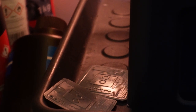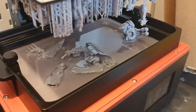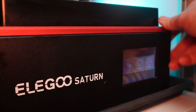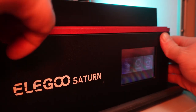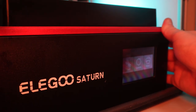But it has all of these small raised bumps on it. And whenever I got my Saturn, I kept getting failures when realistically I shouldn't be getting any at all. I leveled the bed many times and I checked all my settings and they were all correct. Until one moment I just decided, let me just check the machine itself. And I noticed if I pushed down on one end, it could actually rock backward and forward. It didn't change anything else apart from moving it down to make it level. And straight away, all of my failures disappeared.